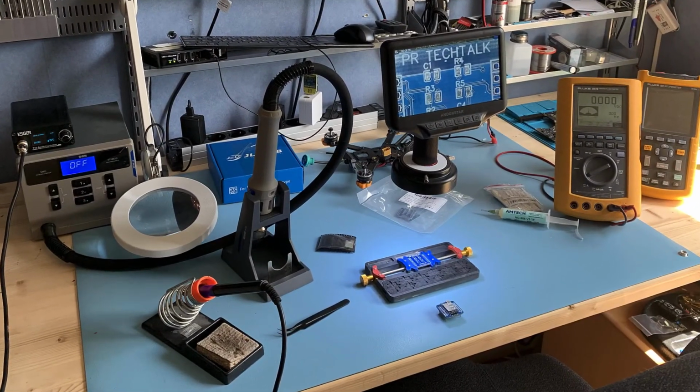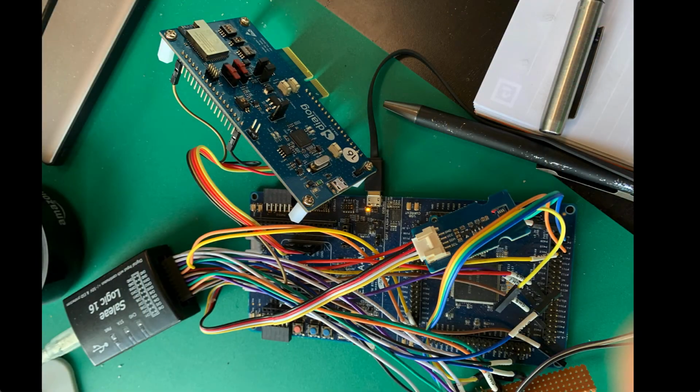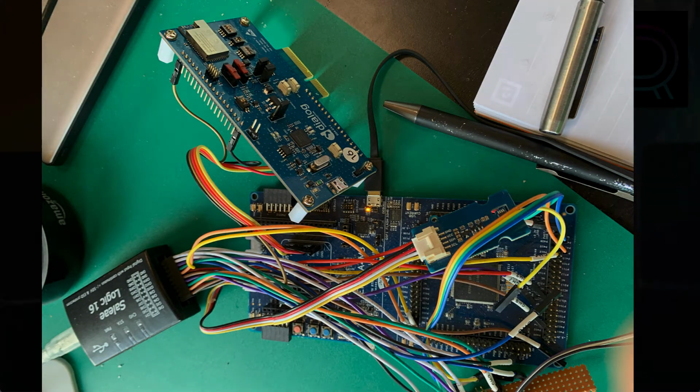You need to initially program the module with the firmware matching your needs. Dialog has an EVK for the DA16200 that can be useful. You get both UART connections available with one USB connector to your PC. I used this evaluation board for the initial testing, but it gets a bit messy with a lot of wires eventually. If you can't find a suitable firmware, you can compile your own.